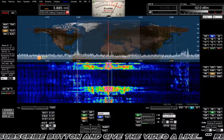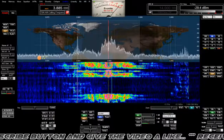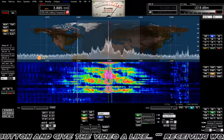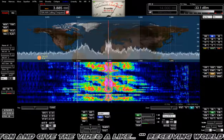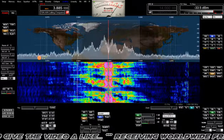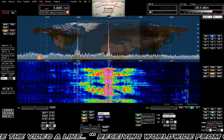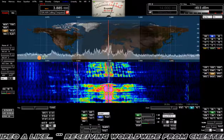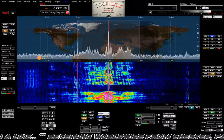Surprised you needed it — it matched the regular Hustlers, because they usually work just great. But it could be the way you have it mounted; it's doing something different than everything I ever tried. I didn't even think about it — it's just standard practice. Whatever antenna I have on there, I do the capacitive matching at the base. It makes a big difference.